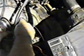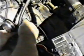Down to 1.01 volts. It was stabilizing at about 170 milliamps about 10 minutes later, after we charged it, and it dropped down to below 1 volt now. The 700 should drop down to 170. We'll check it again in a minute or two. Okay, the voltmeter's reading 700 millivolts now.